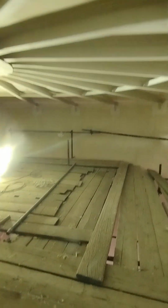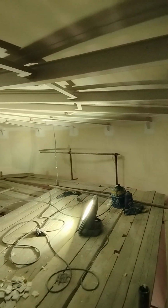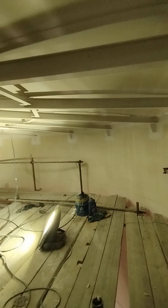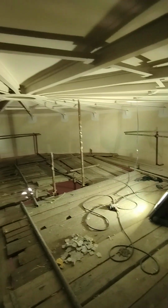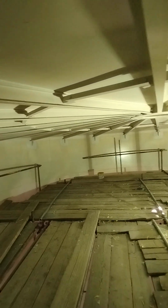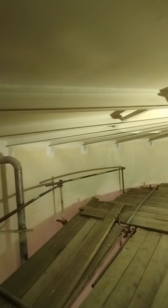Carbon steel is very vulnerable when it is introduced to demineralized water, because it can cause corrosion. So choosing the material for different storage tanks is important.